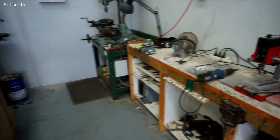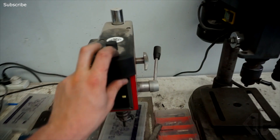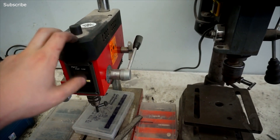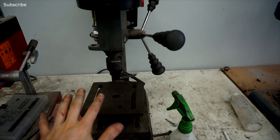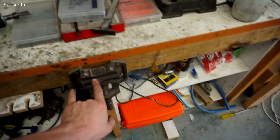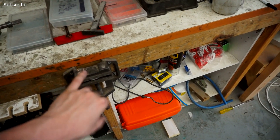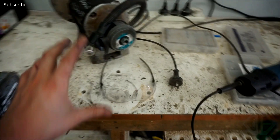Over here is what I'm calling the machining area. We've got my welder over there and just random stuff. We've also got drill presses — the micro drill press here is for very small carbide bits and is mostly used for doing detents. Next to it is my high speed drill for drilling small accurate holes. This thing here is my die grinder — I use this and the vise in unison to clamp blades and round off internal weight reduction holes, so there's no stress riser, which is a potential failure point. Probably not strictly necessary but it's a nice touch for a high quality product.